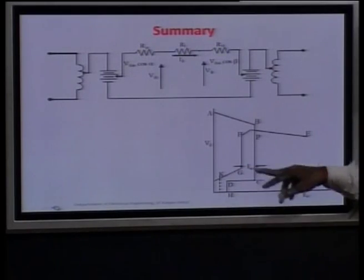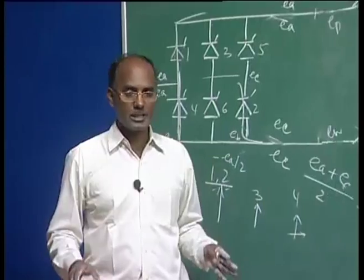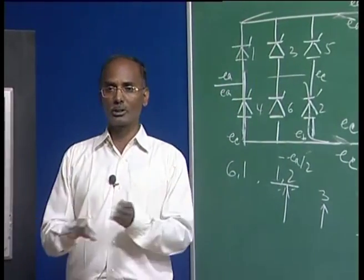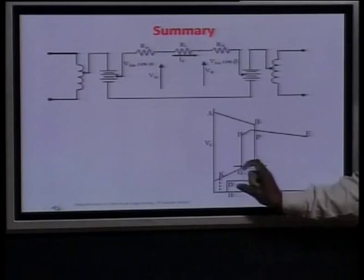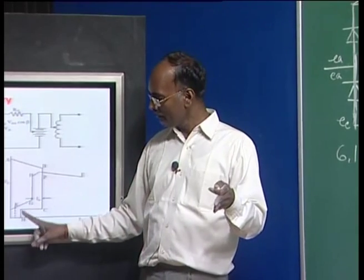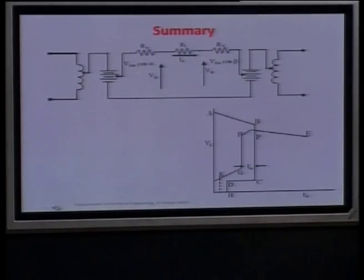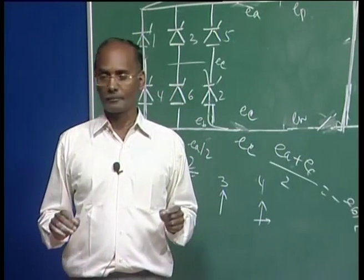Here in this low voltage operation, your thyristors, your converter circuit, was highly stressed. To avoid this stress, otherwise your thyristors may puncture or they may be damaged, we reduced our operation to a low voltage, low current margin. So, the current CC here was shifted to another margin, the set value of the current. And here we again operate this inverter in the beta mode operation for successful commutation, otherwise commutation failure will occur.